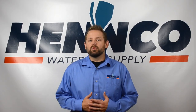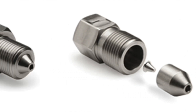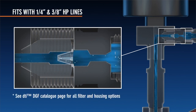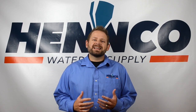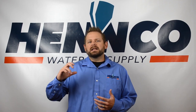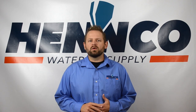How and where do you install your thimble filter assembly? There are high pressure components that are modified to accept your thimble filter, and what is most recommended is to install it right at your valve body. The thimble filter slides into the back of your 3/8 inch or quarter inch bullet right at the adapter that goes into your valve body — that's going to be the closest you can get to the orifice assembly to protect your diamond. If you cannot access that location, follow your line upstream and get it into the closest possible high pressure fitting to your orifice assembly.